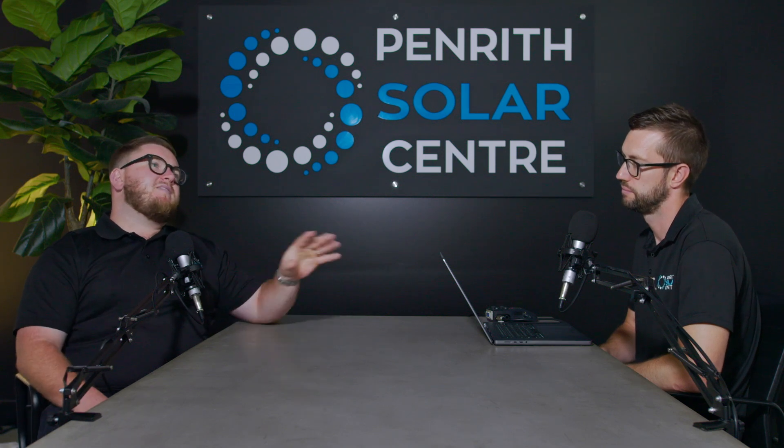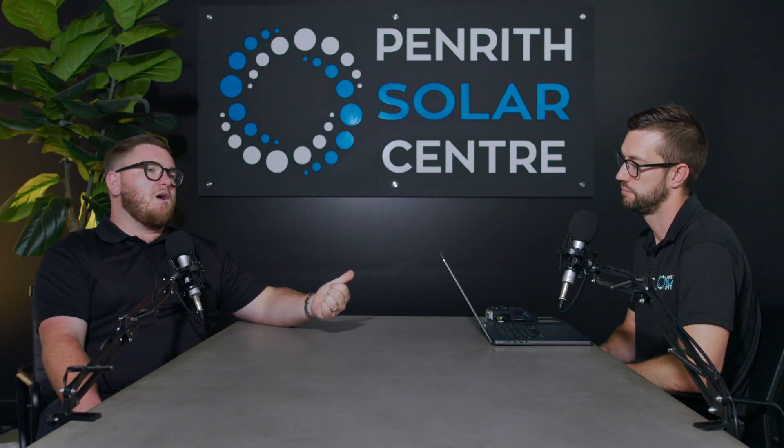Best case scenario: you have a great relationship with Fronius. You get to site, get a unit sent out in about a week, with maybe an hour's labor on the front end plus some admin. Fronius inverters are really quick to change over — the wiring is wired to the base plate, so you can swap one in about 10–15 minutes. Recommissioning might take another half hour to an hour. So all in all, at least two to three hours for a string inverter.